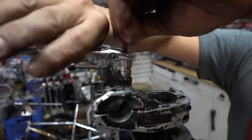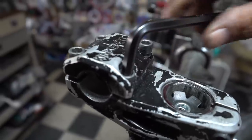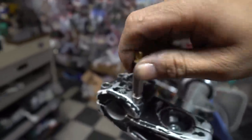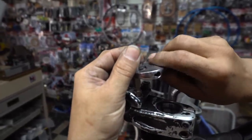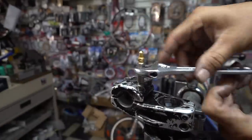See that? It unscrews because it's actually biting into it. Look at that head — look how screwed up that head is. There's no way this Allen key is going to bite into it. The wiggle is not good because when you turn it, it's going to roll out. But I put this in, force it in with the not-quite-right tool, press it down, and turn it — see, it bites into it.